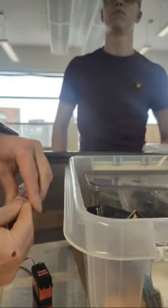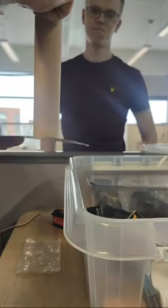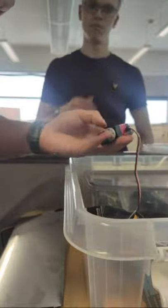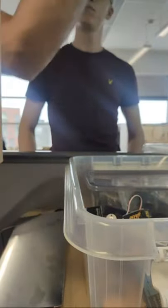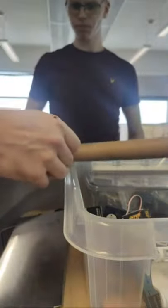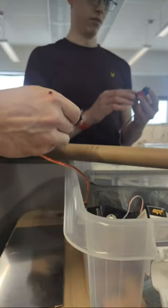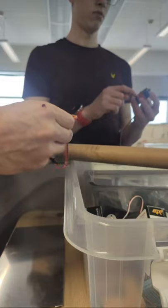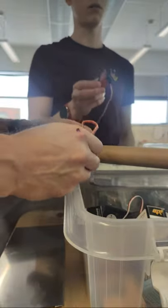Yeah, I made a mechanism over there. It was like a sliding thing that let pellets fall in and then drop them out. But then I did the testing. This worked better, that basically you just go. So we have a fast enough servo. Probably one of the lower kilo servos can be faster. If we just go quickly, it's enough. And when it comes back up, it kind of throws it too, which was kind of funny. So I don't know which is the fastest servo we have here. This is a coreless servo, and if my internet research is any value, I think this should have a pretty lightweight shaft and should be fast. So you can, for example, start trying with this one.